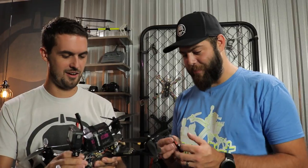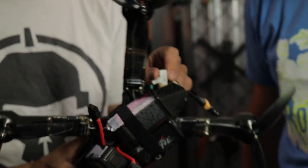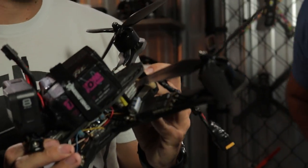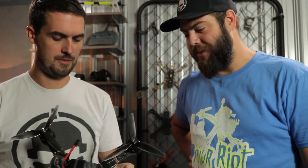That will shock you. When you plug it in, it pops every time — it's a little sketch. I'm also noticing there are two other batteries back here — one cell each. Are these just like tiny whoop batteries? Yeah. So this was just an afternoon idea. I'll just build this quad with 12S power, and I didn't have a way to step down 12S voltage to 5 volts on hand. So I literally just took two tiny whoop batteries, put them in series, and powered the receiver, video transmitter, camera, and flight controller all off of that.